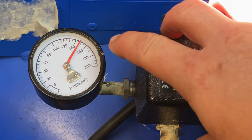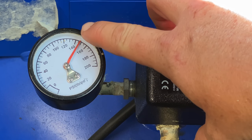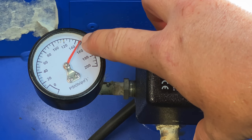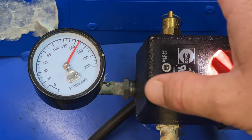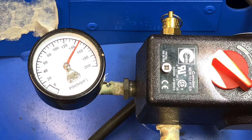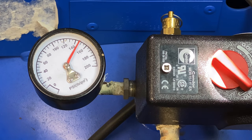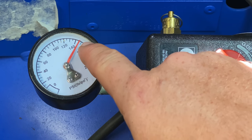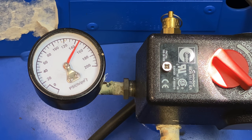As you can see, I'm right there — close to 150, about 148. When the compressor first cut off it was up to 150 and then dropped off a couple PSI. That's pretty normal, because as it's pumping the air is heating up, and when the compressor quits putting that hot air into the tank the pressure drops off just a tad and then levels out. So make sure that when it first cuts off you're not going over the maximum rated pressure for your air compressor.